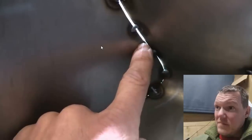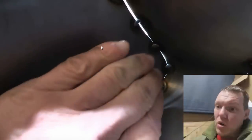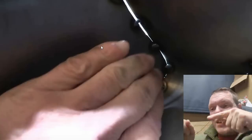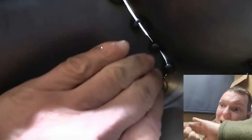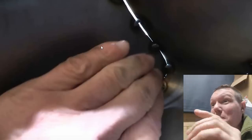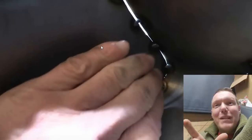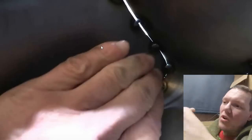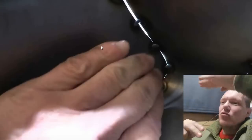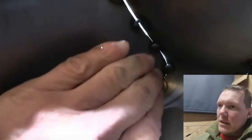That's all it is. From that point there down to about there, I've just got to shape that in. If these two side panels were laid on top of each other and cut, they were literally clamped together. You can even drill two holes, put a bolt through them, secure them together, and grind them together so they match. Then you put them together, and your bit in the middle will perfectly match them. You draw lines on it, the thickness of your ruler, all the way down. You match them up.